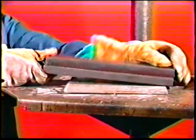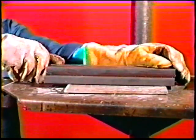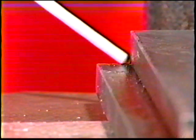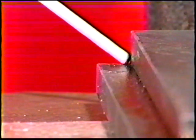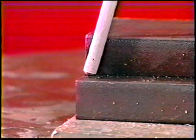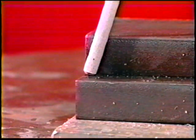Position the workpiece on the table for horizontal welding. The first root pass will be deposited with the E7018 electrode. Position the electrode with a 45-degree work angle and a 5 to 10-degree drag travel angle. Deposit the weld using a smooth, steady travel speed. Do not use a whipping motion since this can result in slag entrapment. As you weld, it may be necessary to adjust the travel angle to produce equal leg dimensions.